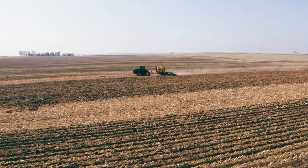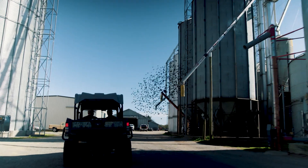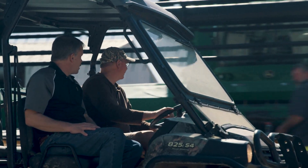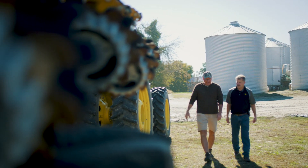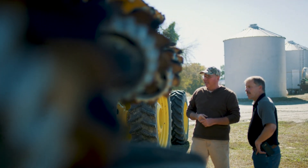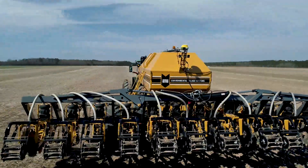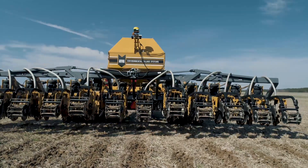The things that we're seeing: the ride is so much smoother, the seed placement is even better. Here I thought we were doing a good job before, but we've even enhanced that and we're getting that uniform emergence. Compared to our no-till environment, when we're planting across those strips and we get a rain event, it dries out quicker. And we also notice the soil is not sticking to the closing wheel or the gauge wheels nearly as bad in the stripped environment compared to the no-till.